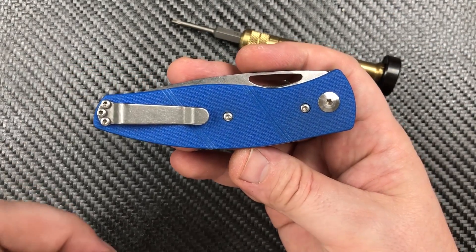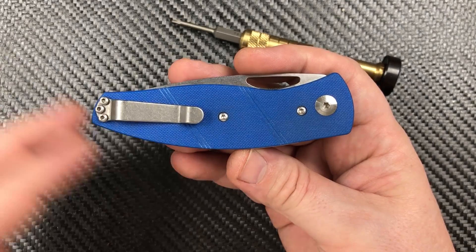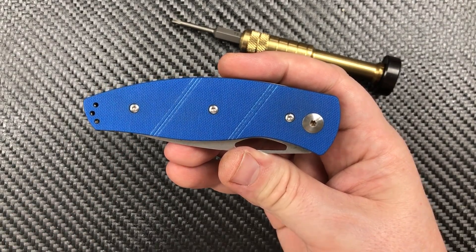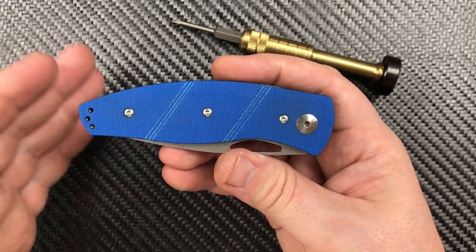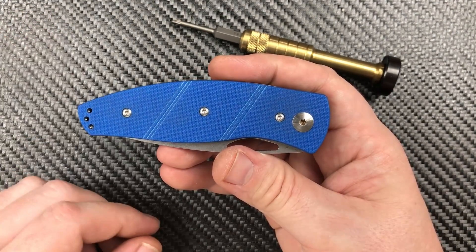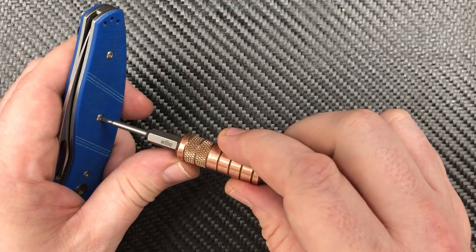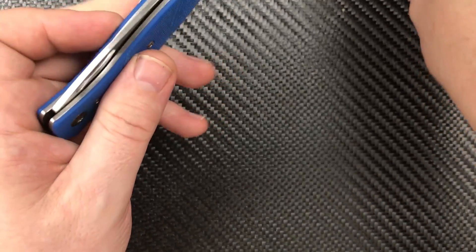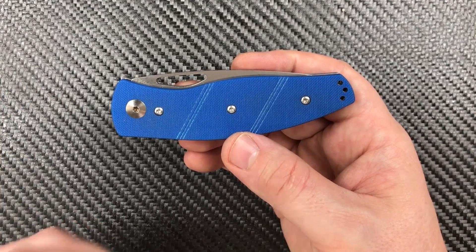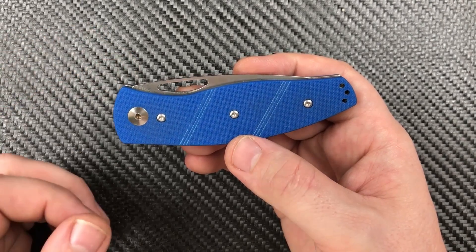That is why T6 is bad. T8 is where things start to straighten out — T8 is much, much better. You can get T8 screws in the same head size as T6 screws, and I know you can get them in titanium: same screw head size, but T8 instead of T6. Any knife manufacturer trying to make a really good knife — I suggest you do that to separate yourself from manufacturers using inexpensive T6 screws. This is a semi-custom knife; let's elevate into the T8 realm where your customer doesn't have problems, especially those customers who aren't knife guys or tool guys.